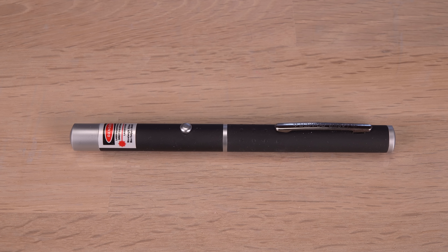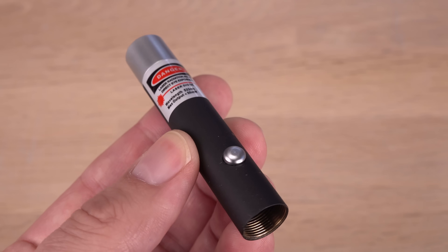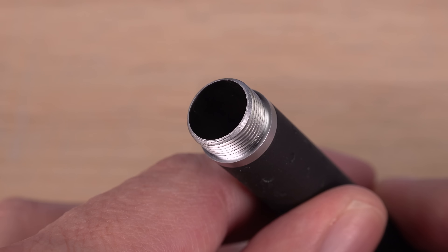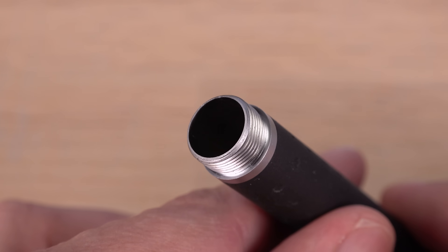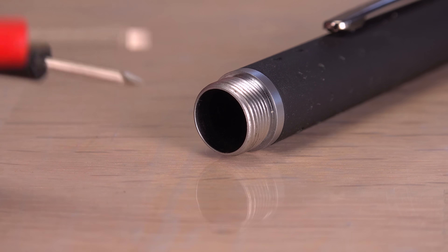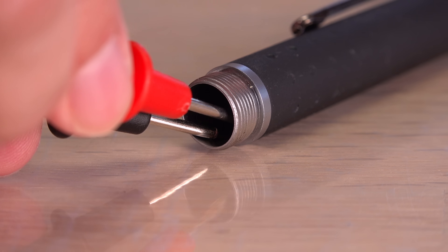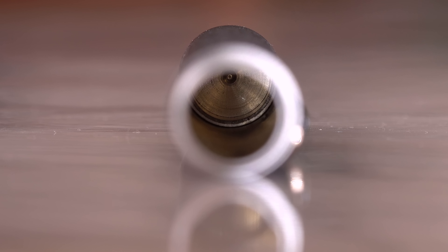This more common design with an on-off push-button on the driverboard cannot turn on just from a peeled battery. But peeled batteries can still be short-circuited, unless the inside of the tube is non-conductive. It does look coated — maybe they did consider the risk. Nope. This older model is fully conductive on all of the inside too, relying on the batteries to provide the electrical insulation. Not great.